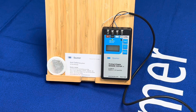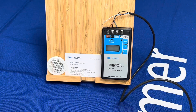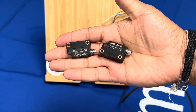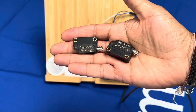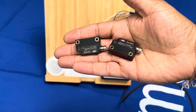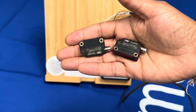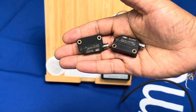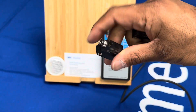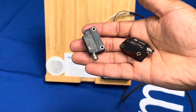On the through beams we give a sensing distance of 10 meters. The sensors come with various output options: push-pull, NPN, or PNP. In terms of mounting, smooth or M3 threaded holes are available, all with metal connectors for robustness and a nice solid hard plastic IP67-rated housing.